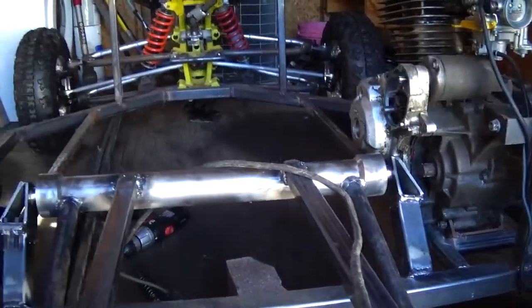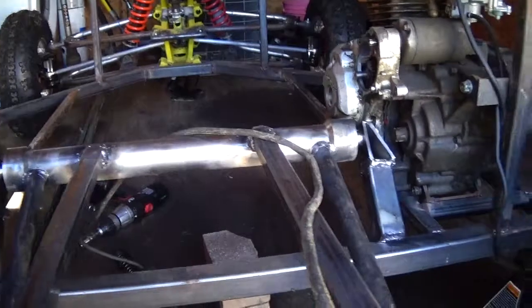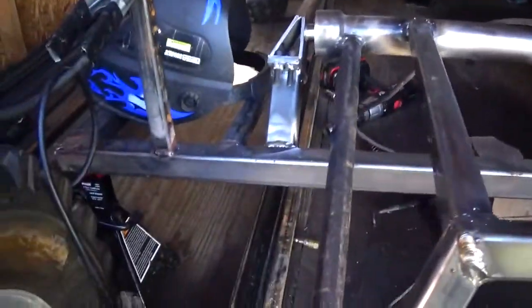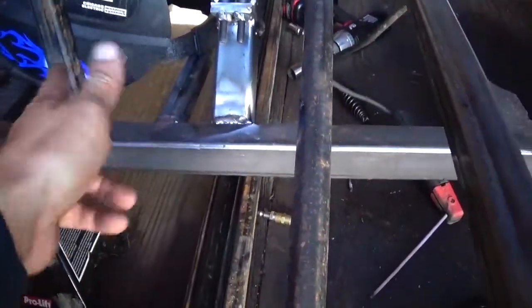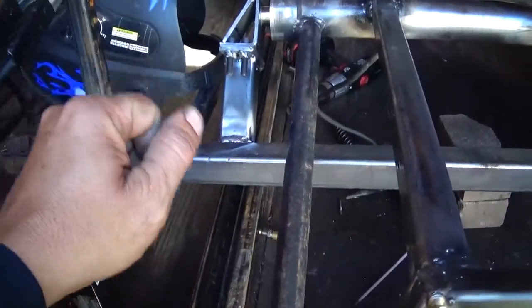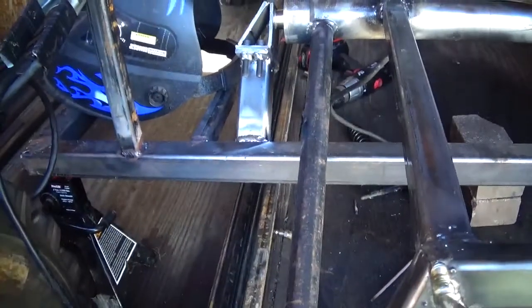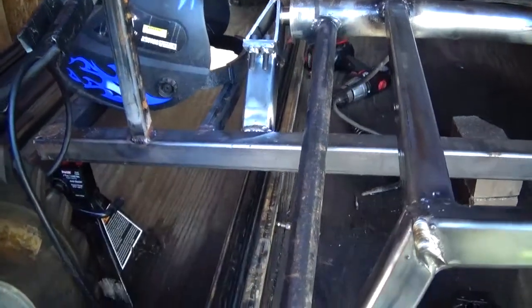I had a comment saying this frame was going to twist the hell out there. I just wanted to make a mention that it wasn't really — it was just a footprint of a frame out there. It is so much easier to put down weld here. I just take that stick welder here and I can just go. Out there I had to work with the generator — you kept arcing it and arcing it until the generator picked up RPM, and then you could hear the generator going up and down as I was going across the weld.